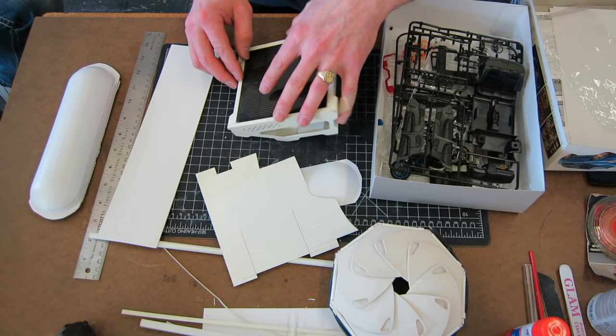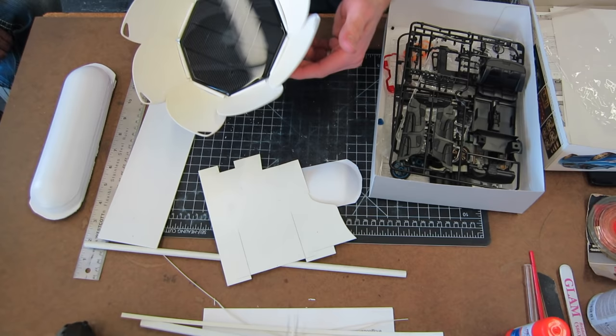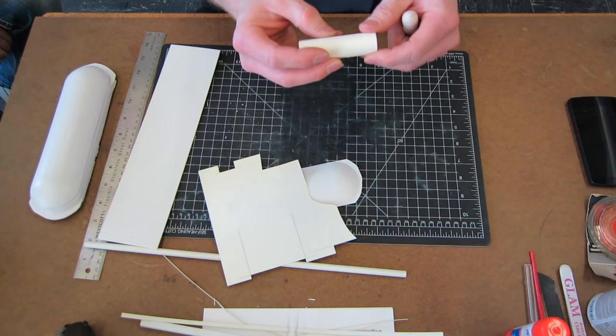Here's a quick example of a model I built out of styrene — a little solar charger. It's used to simulate the final product and show material thickness. It's very easy to make a functioning model out of styrene. The petals on this solar charger were vacuum formed first, then laser cut so they're all the same, and then assembled into an easy-to-make functioning working mockup.